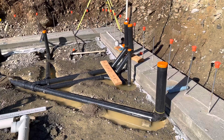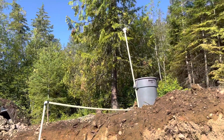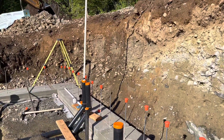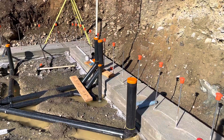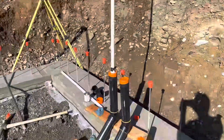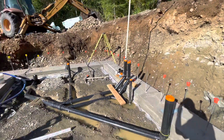The inspector wanted a 10-foot static water test, so I jury-rigged a system here with a one-inch pipe and a bit of a funnel at the top. It worked out pretty good. The only problem I had is that these joints leaked a little bit right here — I just taped together some PVC, which is adequate, it holds the liquid level, but it's not ideal.